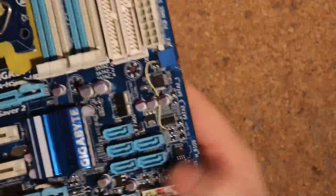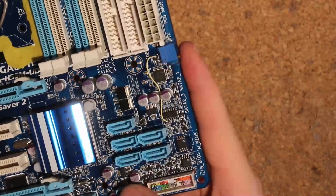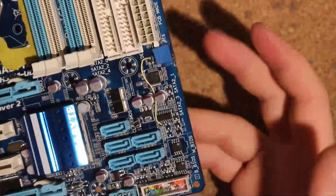This is your typical LM324 here, so in this case we are connecting it to the non-inverting input of this thing, so it's really straightforward — it's just a variable resistor.